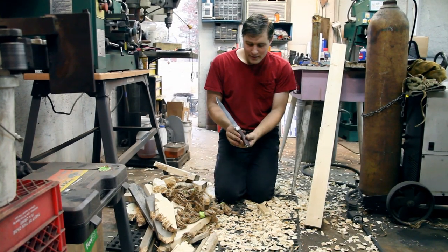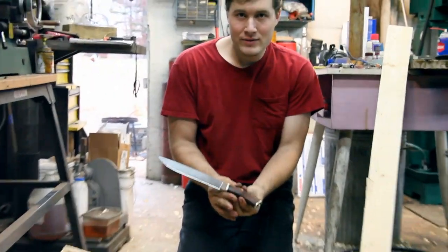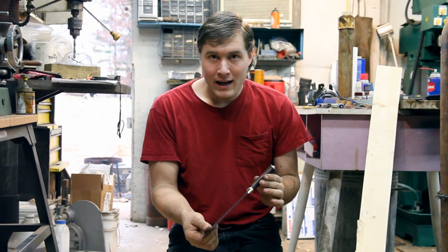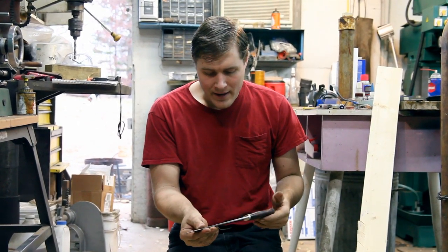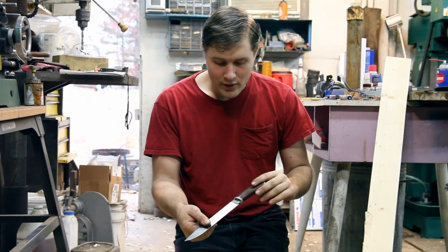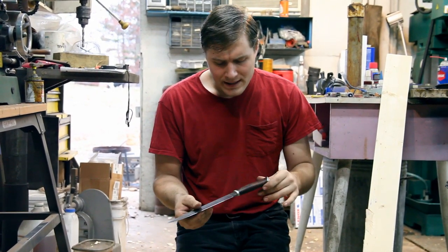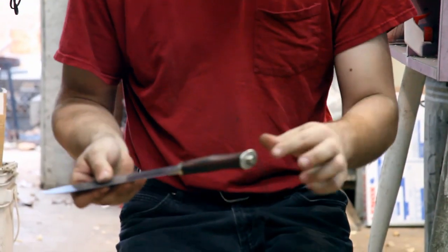Here's my third knife. This is the actual knife I'm going to use. I'll be testing with this. The blade is heat treated exactly the same as the other two I made and tested here at home. The handle is desert ironwood, just a real straight grain piece. Should be real nice and strong. It's a through tang construction.